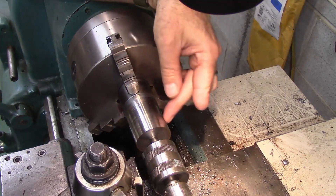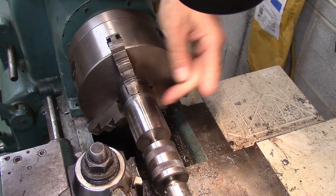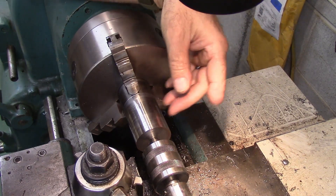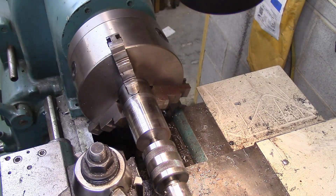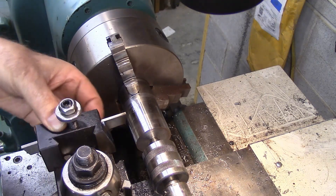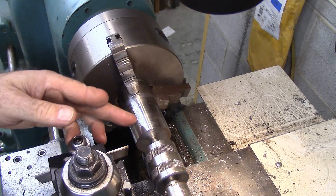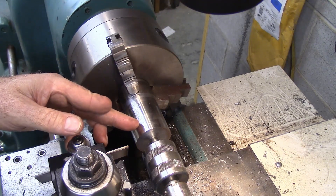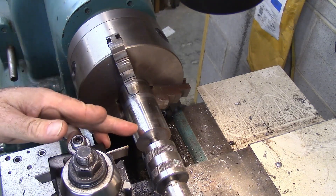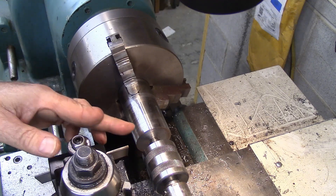To make the wheel part of the pulley I've got some two-inch steel chucked up and I've got it roughed out. It's scrap that I got from the scrapyard so I don't know what it is — I got the rusty crust off the outside. I'm going to take a parting tool and start marking out the divisions of where I'm going to cut them. I'm going to use roller skate bearings on the inside, and those are like 275 thousandths wide, so I'm going to mark those out and then start cutting the groove where the wire will lay.